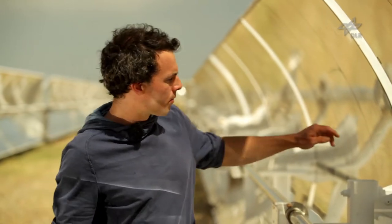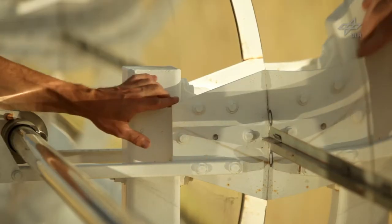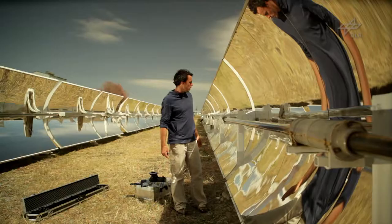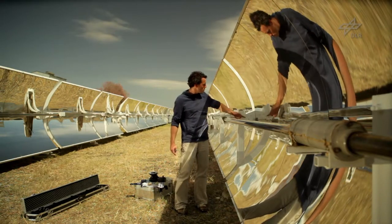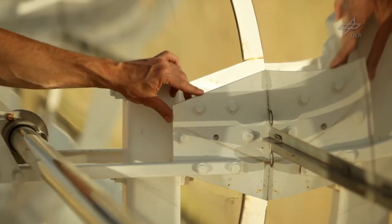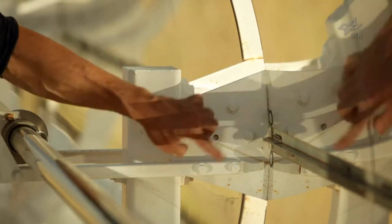Another important feature is the position of the axis of rotation relative to the vertex of the parabola and to the focal line. For some reasons it makes sense not to measure this point directly, but to attach photogrammetric targets to the flange around it and then afterwards calculate the center by a circle fit.